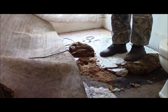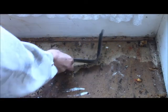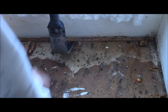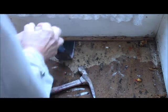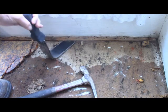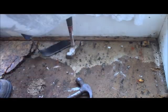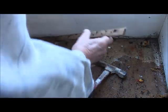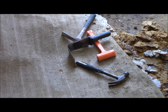There's the wood underneath. All the saturated stuff is going to have to go. My own homemade carpet lifter tool, plus a mason's hammer, plus an ordinary claw hammer, does good in removing these tack strips. My small tools, including my homemade carpet lifter, are fine for working in close places and around the edges.